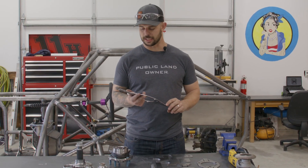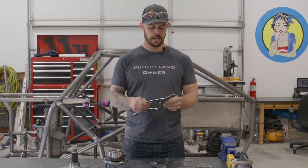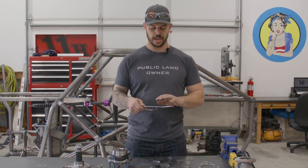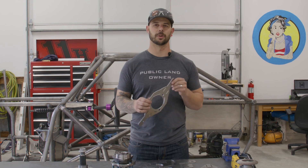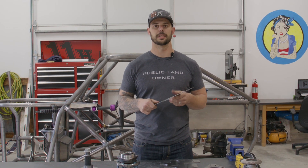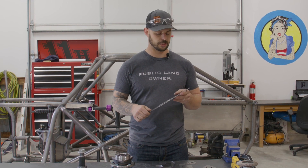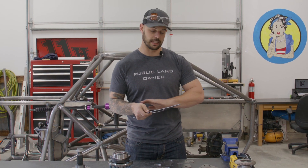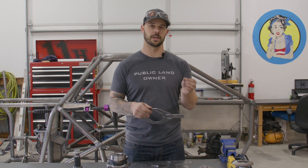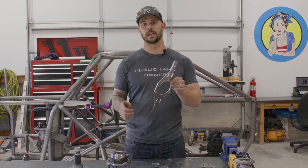Let's take a look at the parts we got back from SendCutSend. I made them out of 104 thousandths of an inch thick mild steel. They have all the features we're looking for. They do have just a small little bit of a burr — it's common to see that with mild steel. They don't go through a deburring process because most deburring processes use water, which would cause the parts to flash rust. So I'm going to touch up all these parts. Since we have tabs and slots, we need that burr gone — we'll do it all at once, then start bending and welding.